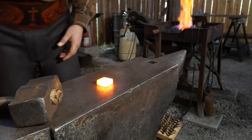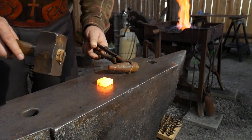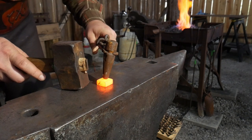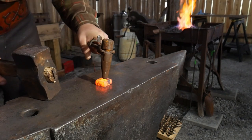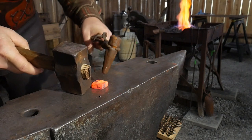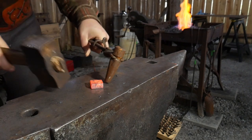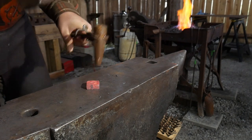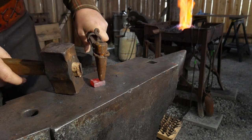After everything cooled down and annealed a little bit, we're going to work on hammering this up. We're going to use a little ball punch - this is about a 3/8 inch diameter ball punch, tong-held of course. Any piece of mild steel that you've ground a ball or a little radius on the end of will work out just fine; it doesn't have to be tool steel specifically.